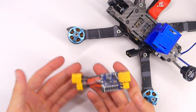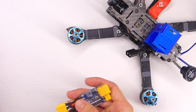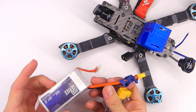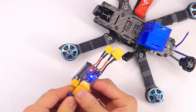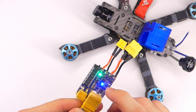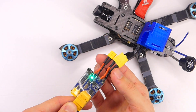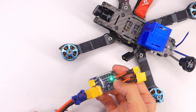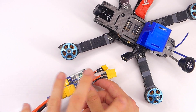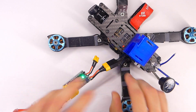Since this is a current limiting device that will shut off power if the current gets too high, you can actually power on your quadcopter through it. For example, I have a four-cell battery here — we connect it to the smoke stopper, get a green light, and there's also a blue light indicating a 2-amp cutoff. Flipping the switch removes the blue light and sets it to a 1-amp cutoff. The 1-amp setting should work fine according to vFly, but larger setups may need 2 amps, since all the electronics draw some milliamps just by being on.